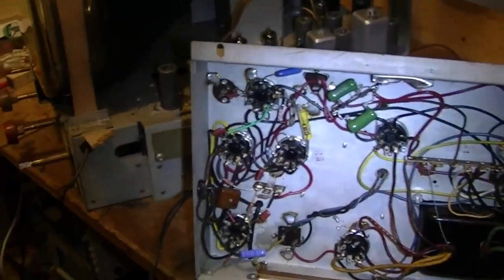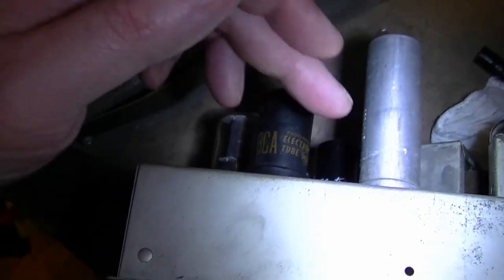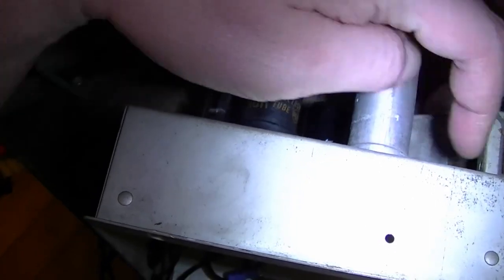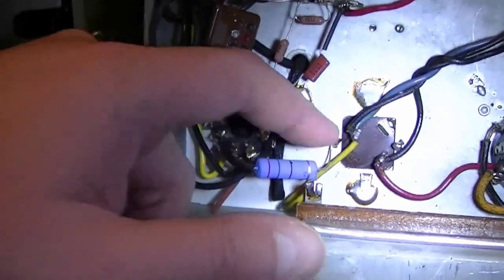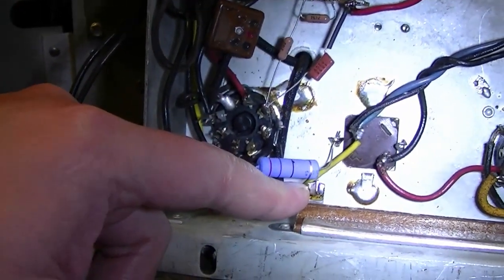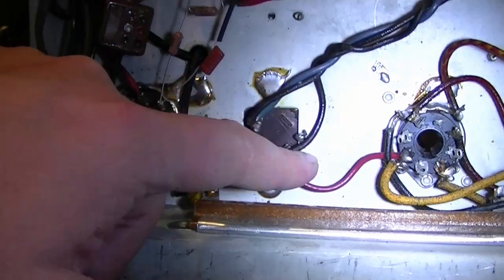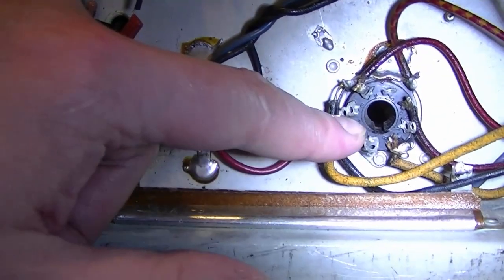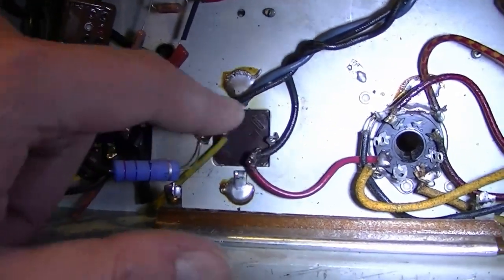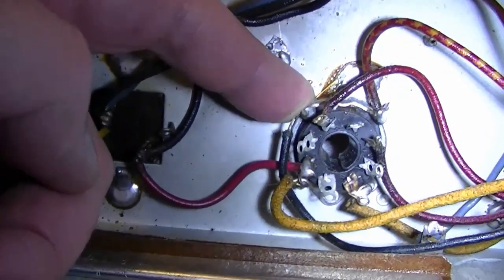Next I want to tackle the electrolytics on the power supply. I was going to cut these open maybe 3/8 of an inch from the base, clean out the insides, drill some holes down, mount the new caps, and put it back over. However, I looked underneath — it's just too easy to mount them underneath the way they have this laid out. For example, down here the two-section cap has one lead going right over to the big lug on the power resistor. So I attach one lead of the capacitor there, other one to ground. The other side goes over to the filter choke, and the other to the rectifier tube. We take this wire from the filter choke and run it over, because we don't want to leave these capacitors connected in case they're leaky or shorted.